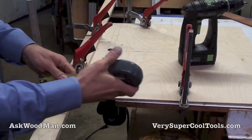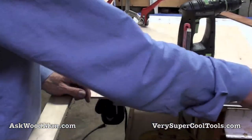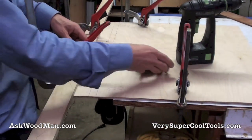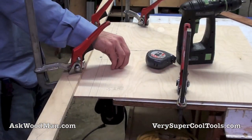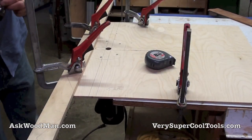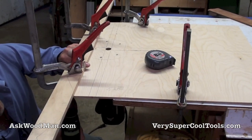I'm attaching this fence at 5.2 from my center line, because that's what it is — I'm measuring to the center line where I've got the little red circle, and I'm going to attach the fence. The only reason this is long is because I've had this half-inch piece of plywood for years, and I use it all the time. I'm not going to cut it for this, so I don't mind if it's long. It'll be just fine.